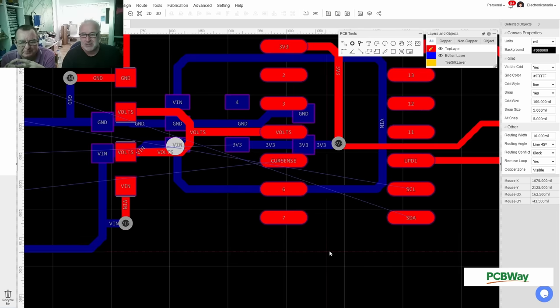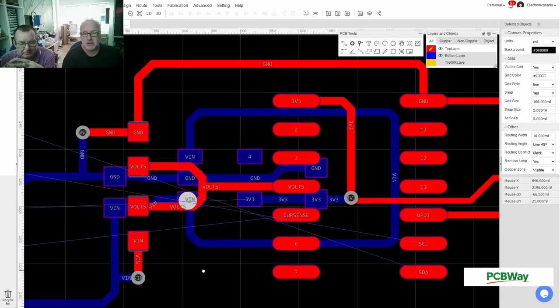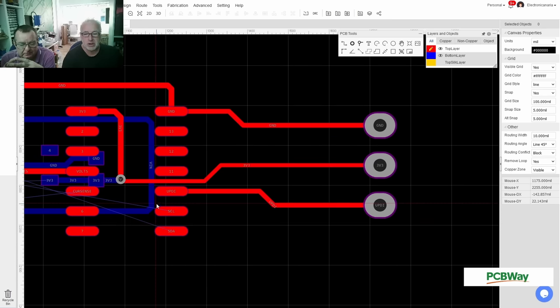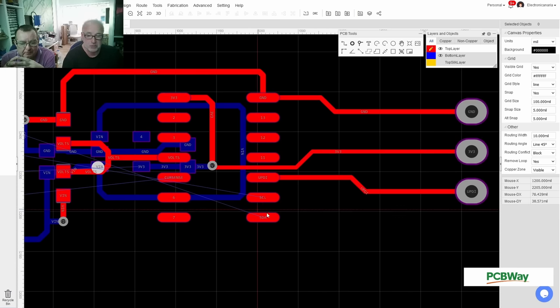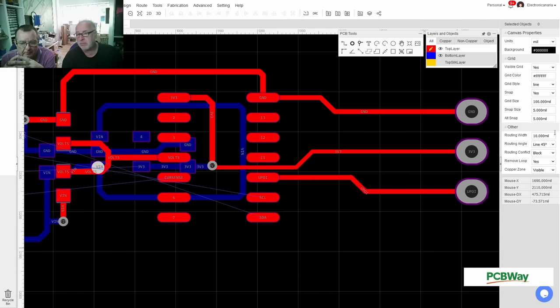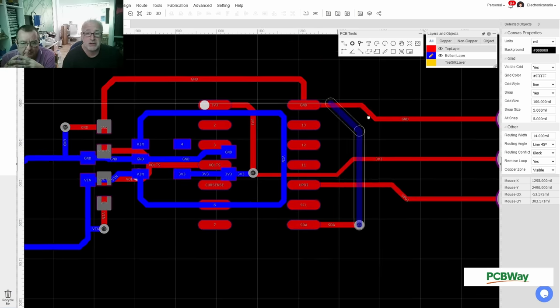All right, we have SDA and SCL. So these are my data lines. Oh, look at this. We have space for this. Oh, nice. They are not critical. So I probably go here, move up there, and go on the lower side of the PCB down here. SDA? Yeah, so start with SDA. Why? Go up. Okay, I want to have some bigger things in here. So 14 is a good measure. Go. Here, go down to the bottom side.